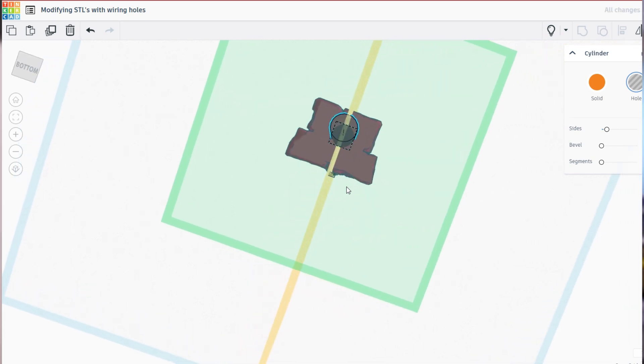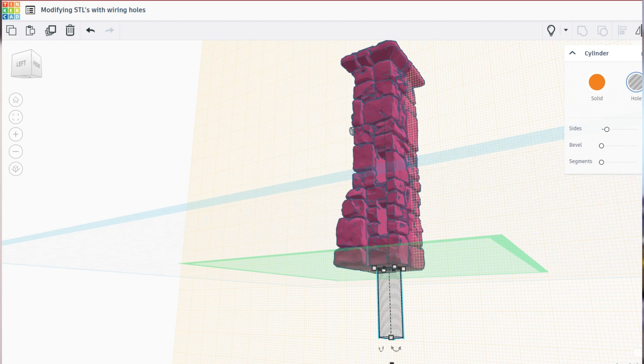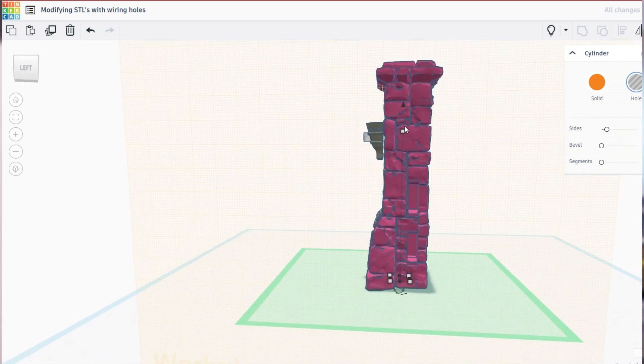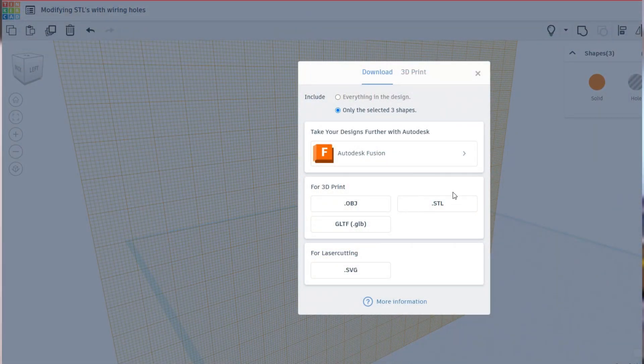I added a tunnel from the floor up through the pillar. Using the same box trick to create a work plane roughly through the middle of the pillar — I could use the align tool if I wanted to be more accurate — I then add a hole cylinder roughly five millimeter in diameter, then extrude it up to hit the three millimeter horizontal hole I created. I now have three objects. Hit export, make sure it says all three objects, and it'll combine them and add the holes.